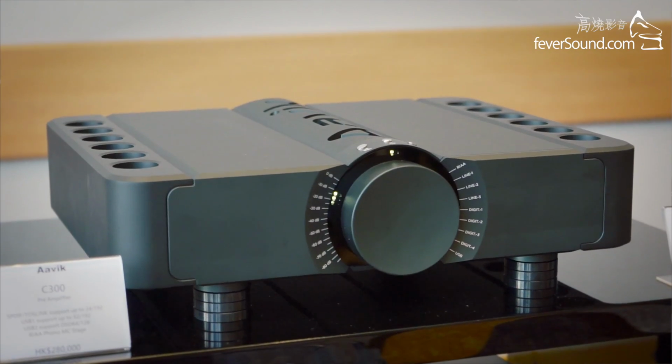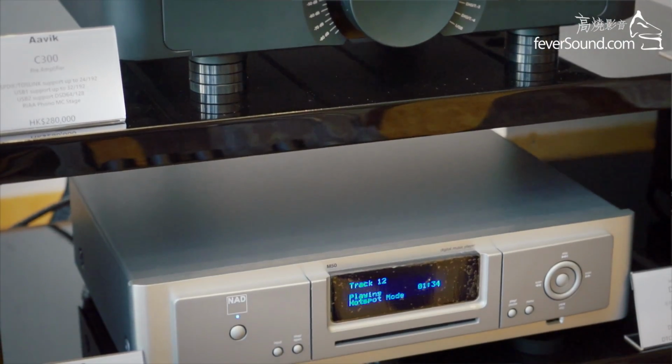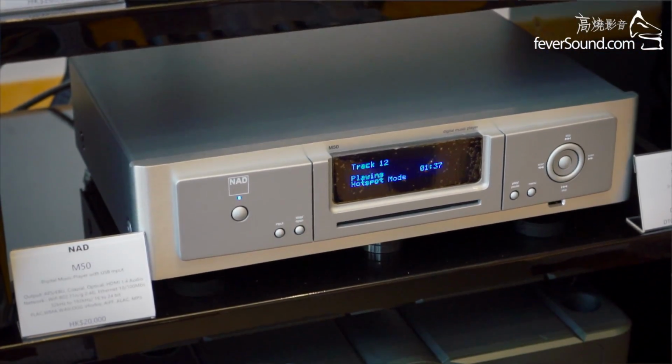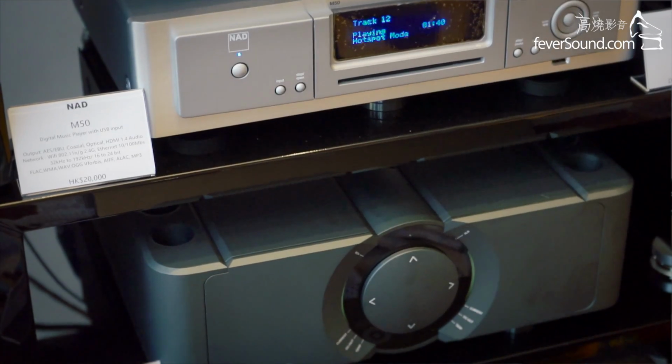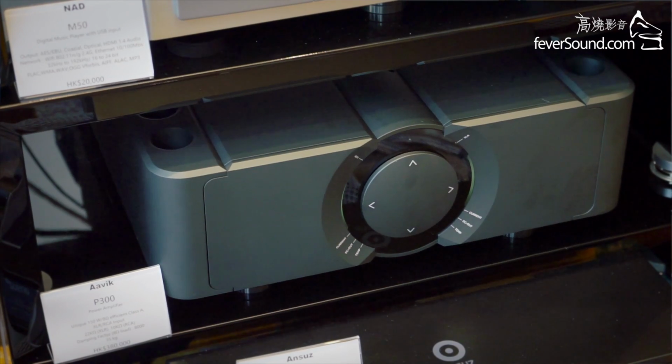For high power in a small package, like we have in the U300, we have 300 watt in a small package. That is not possible with this technology. And there Class D is a better option to make compact integrated amplifiers. And you can say that when Class D came out, the only benefit of that was high efficiency, because they sounded terrible and they got a very bad reputation at the time. That was because the components available for the Class D were not as developed as they are today.